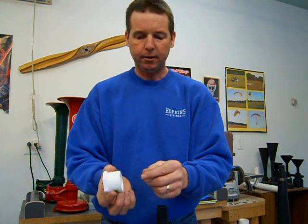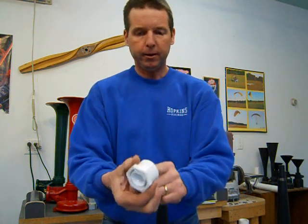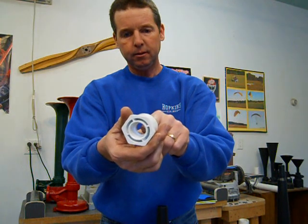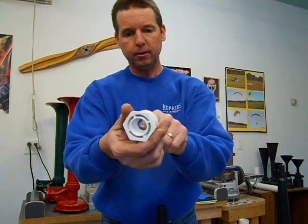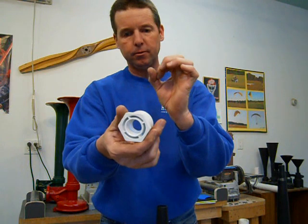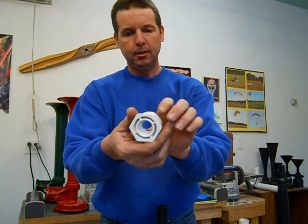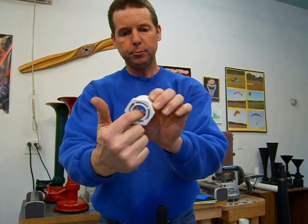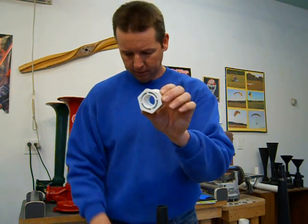One important thing there is you only want to get rid of that ring. I'll show it from this side, maybe you can see it better. Get rid of that ring, grind that right out. If you go a little oversized, a large round hole is fine back here. But we don't want to disturb this inner bore, the nice smooth part. Just leave that alone.